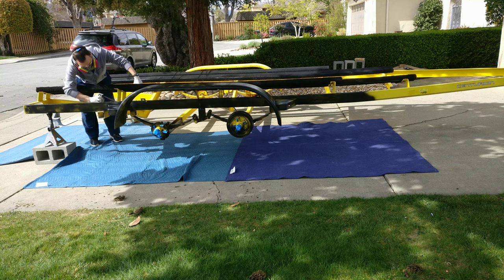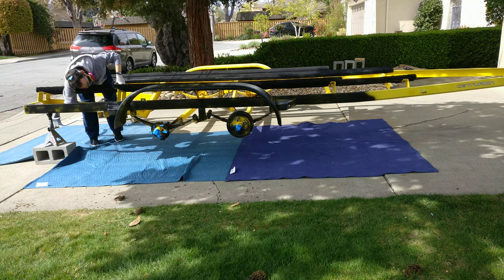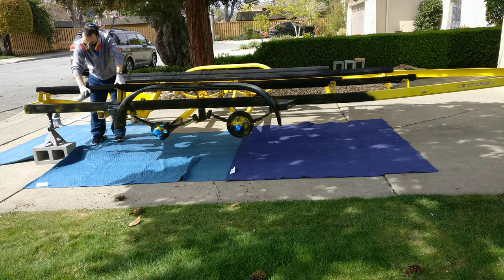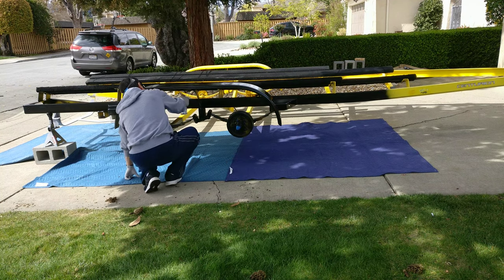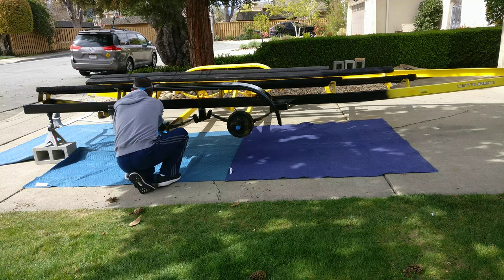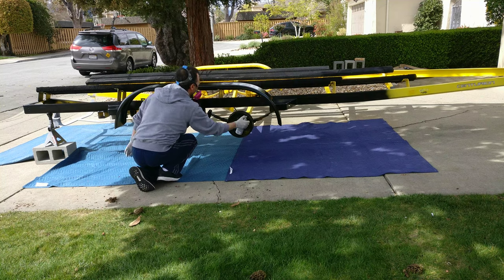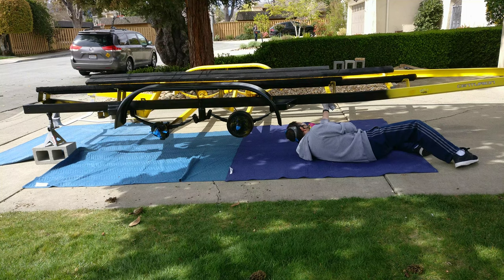As you can see here on the left side, you can see the yellow sticking out of the black layer, and I had to go over it a few times. I also had places where the paint started to get an orange peel effect, so I had to go back, scrub it, sand it, and re-apply. That would have been much better if I had just used a brush first, then covered it with spray at the end.